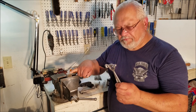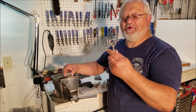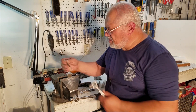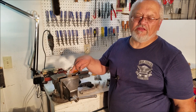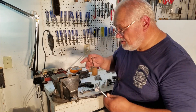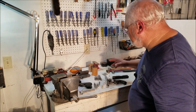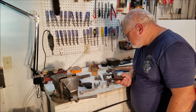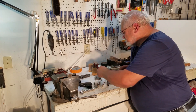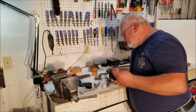It's really helpful on round pieces when you're trying to find the exact center. We always made fun of this because you look at it and say, 'What are you going to use that for?' But it actually has an exceedingly important use — because if you get that hole off a little bit and it doesn't line up with the next piece, you're going to have a hell of a time getting screws through because they'll be offset. I used that tool when we cut the barrel down on the Mosin and had to drill holes for the new ramp sight — I knew what size my hole was and was trying to get my starting point exactly center so the screws would fit. That's exactly what it's for.